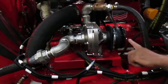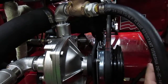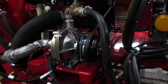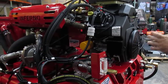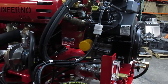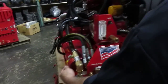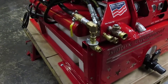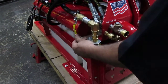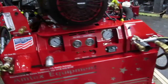At the same time it is controlled by a clutch — in other words, even though it is driven off the shaft of the engine with a 6-to-5 pulley ratio giving the pump 3,600 RPM with the engine running at 80% of its capacity, which is 3,000 to 3,100 RPM, it can remain off unless the operator decides to do a pump-out. Your APO switch is on the far left, and you do have a flow control valve right here so you can control the flow and slowly pump water in restricted areas.